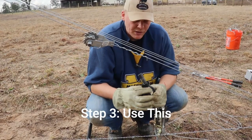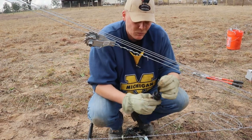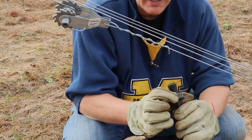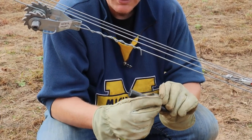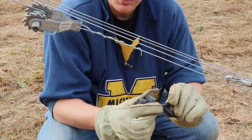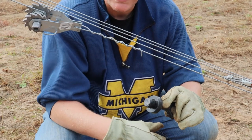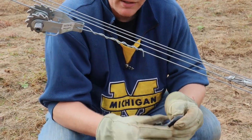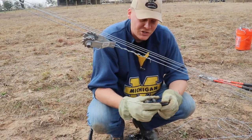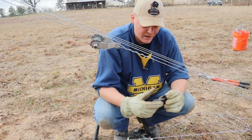This is the barbed wire puller — it's like this Celtic-looking thing. The barbed wire slides into this slot, you put it in, rotate it around when it's on the thin end, and then as you pull it, it binds and you're able to pull it really, really tight. Very, very simple. If you're working with barbed wire and you have to tighten it, this is a simple, cheap tool that does great. You just connect it to the other side of the come-along and it works perfectly.